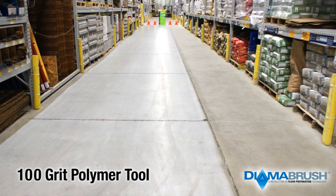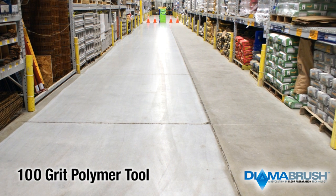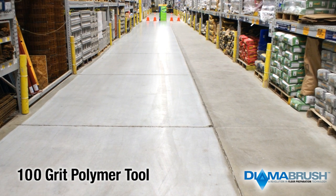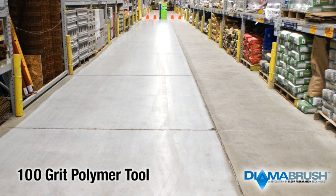We've just completed 6 passes with the 100 grit polymer tool. The floor should start to take on a slightly darker color and start to feel somewhat smooth to the touch. Again, the goal with the 100 grit tool is to take out the scratches left by the previous step with the 50 grit tool and make the floor smoother.